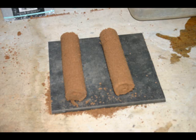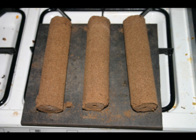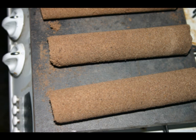The next bit is probably best done when the wife's out — bingo, shopping, whatever. The plate and the cores are put on top of the oven and cooked at 200 degrees C until they stop smoking. It smells not too bad, it smells like a treacle cake being cooked. Better cores can be made using linseed oil instead of molasses, but they actually stink the house out.